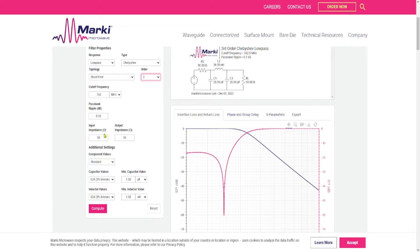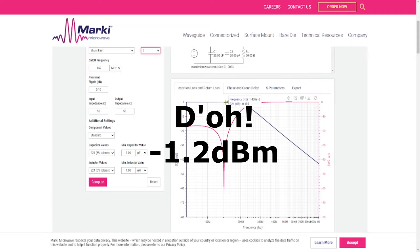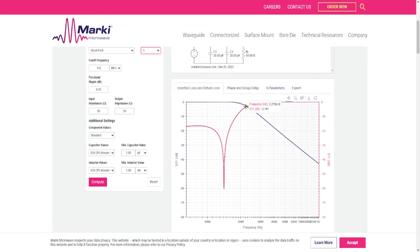The test radio is a TalkPod — I think it's the E31 or E32 or something like that — and its impedance is unknown. I took these component values, picked standard values, didn't have any of them, so I had to make my own inductor and get close with the capacitors. The blue line on the design tool shows the expected roll-off. At 146.52 MHz the expected insertion loss is 0.185 dB and ours was around 1.8 dB. The 3 dB roll-off on the design is close to 200 MHz. Our curve looks a little steeper, probably because of the unknown inductance value.